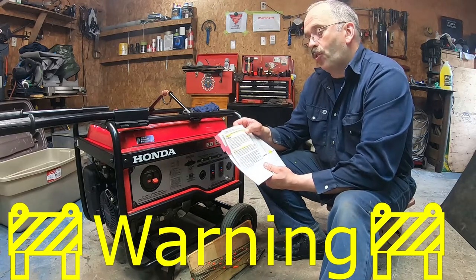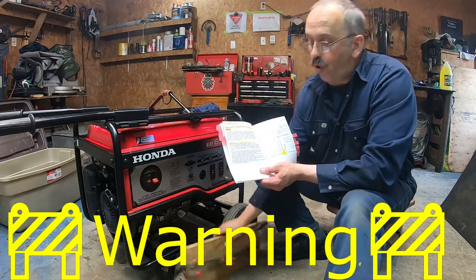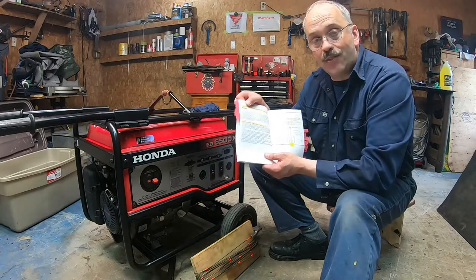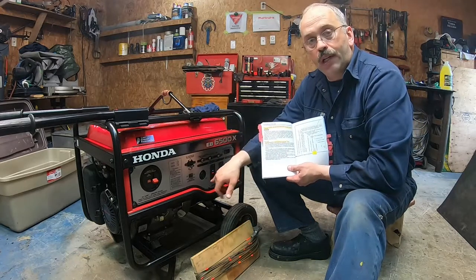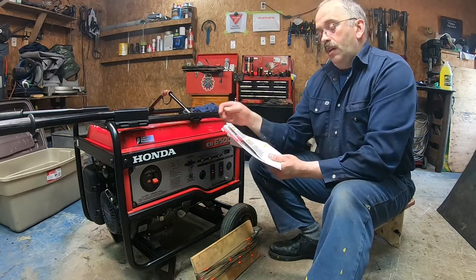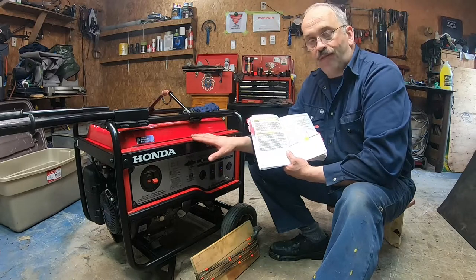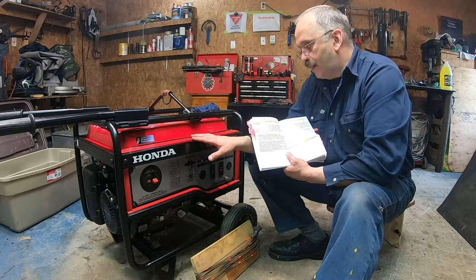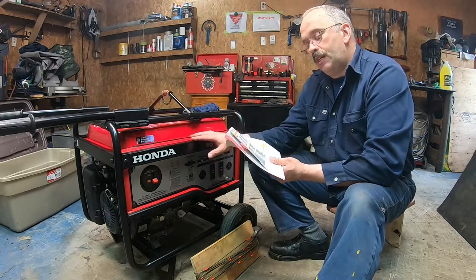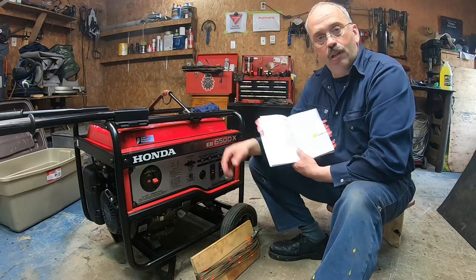Generator use: be sure, again, it's related with the ground. On page 34, be sure to ground the generator when it's connected to equipment that is grounded. It's very important, so the GFI will work, and also to protect the generator itself. And of course, they talk about not overloading your generator. If that thing can run at 5,000 watts, don't put 7,500. It can go at 6,500 for a minute, I think. They also talk about the distance of the cable you can run from it.